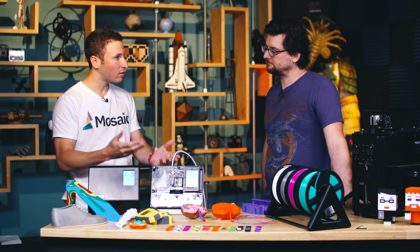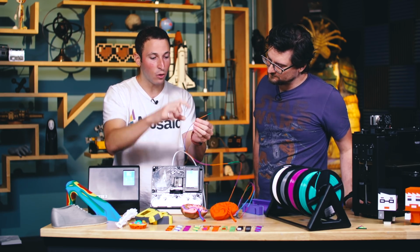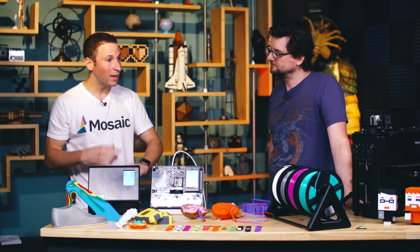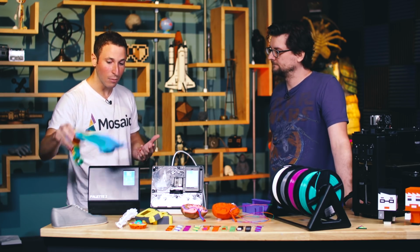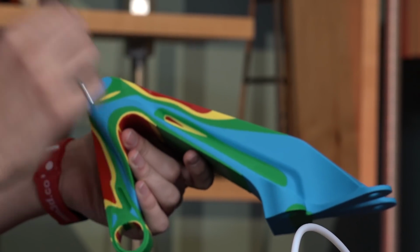So when Palette turns on and gets started, it knows, I need the first piece to be that long, and then orange needs to be that long, purple needs to be that long, and it does that for every single piece. Not only that, it's actually making corrections on the fly, because we all know sometimes printers will over-extrude, under-extrude. It's doing that the whole time to make sure that in a print like this, where you might have 1,500 splices, each one is going to arrive at exactly the right place.